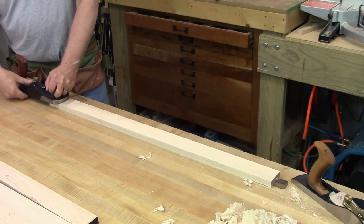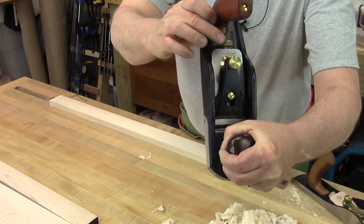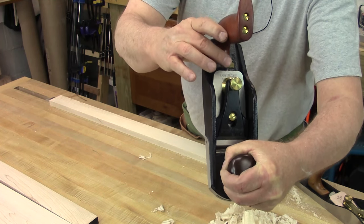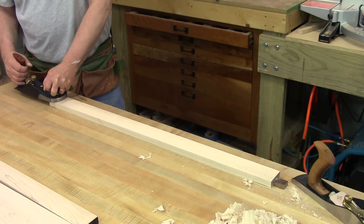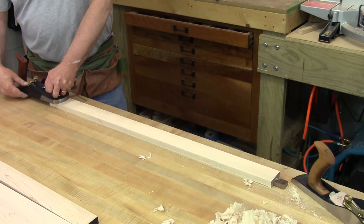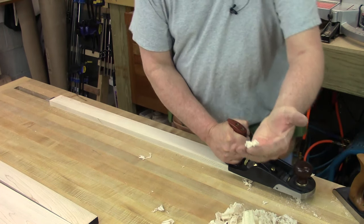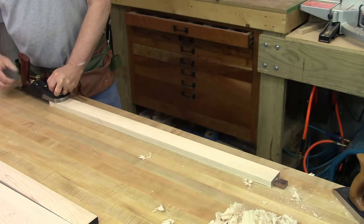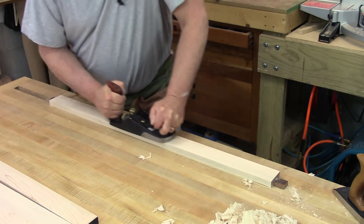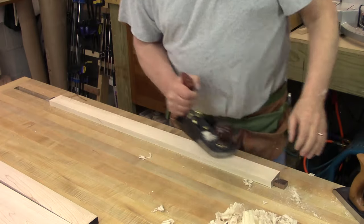It's taking nothing. This one's got just a slight little backlash. When you're dealing with the plane and you're adjusting it, you're taking that wheel and you're moving it back and forth — you see how easy that moves? That's really not moving the plane any at all. So every time you want to tighten the plane, if you loosen it, you have to tighten it back to its tighten point. So that's just snug. And I'm getting just what I call sawdust. So I'm going to tighten it just a hair more. That's what I want — I'm getting the lightest cutting you can possibly imagine right there. That's beautiful.